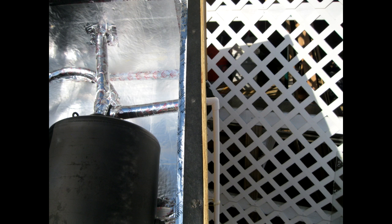Here is the pop-off valve going to the outside of the tank and spouted outward. At the bottom of each tank is a drain valve — this style uses recessed drain valves that go into the tank about six inches. That means there's about six inches of no water on the outside, so there's less danger of freezing. The valve is located close to the tank where there's a large body of water, reducing the chance of water freezing and breaking the pipe.